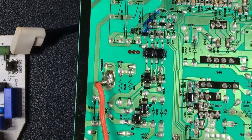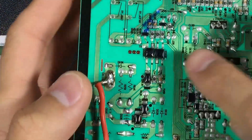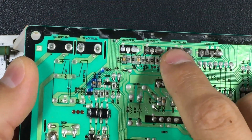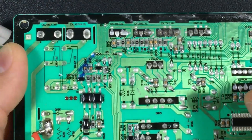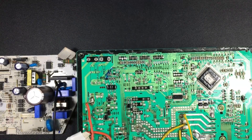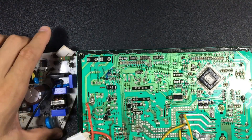What else do we have to do? Very important: follow the tracks. We always say the same thing — follow the tracks, always, no matter how long they are. Look at this case: we cross jumpers, we go around here outside. Look at the turn we are making. Here we will only be reaching the microprocessors. So follow the tracks, because they can be cut and the communication stops, and we replace components or even want to replace the board, but we forgot to follow the tracks. It is like a cut cable. Please, let's follow the tracks in this part of the circuit.